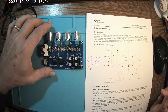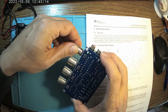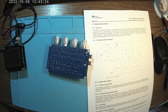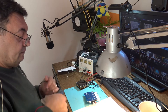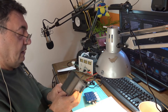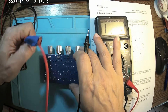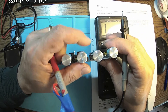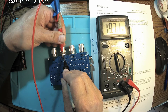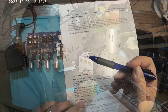These potentiometers should be linear, because they are — except this one which is the input volume. These are the tone controls. How can we find if they are linear? Very simple — just put it in the middle position and we should have equal numbers from the middle pin to the left or right. Around 20 kilohms. Let's see — approximately here, around 1972 and 1749. This is very good.